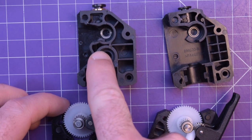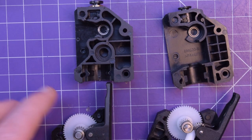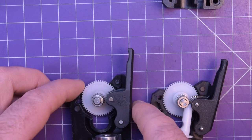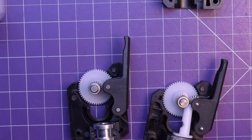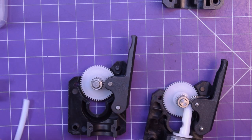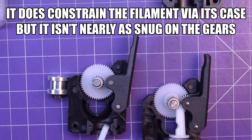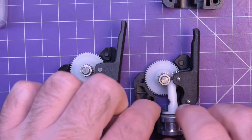This area is actually where the little gear goes for the stepper motor. The stepper motor comes up through the back here and that gear will be supported there — it's not even supported with a bearing, it's just going to be there. And if we take a look at the filament paths, you'll see this one here is not actually restrained by anything. I think the Bowden tube actually can come up through here and the Bowden tube comes up through this V6 mount. That's not as good as this guy here which actually has a split for it. There's the V6 mount on this one, and there's the V6 mount on the other one.